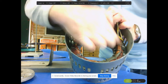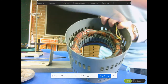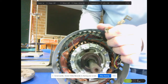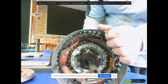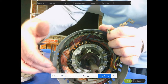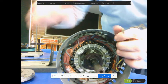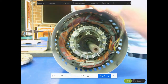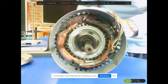And this happens at remarkable speed, at the speed of 50 hertz, okay? And as it goes around, the spindle that is inside gets dragged along with it. Just similar to the copper sheet a few moments ago, getting dragged along by the rotating magnetic field. Here, the rotating magnetic field is a series of electromagnets on the outside, and so the coil, just put that down so you can see it. The magnetic field rotates around here very rapidly and drags the spindle in the center around with it.